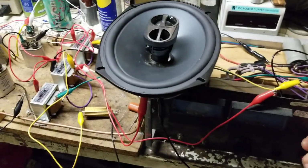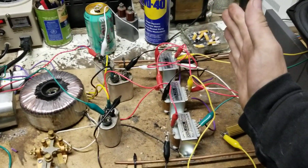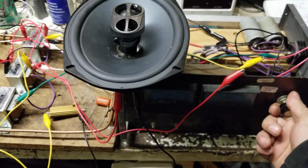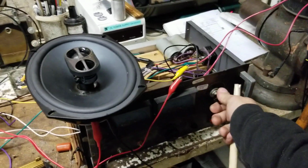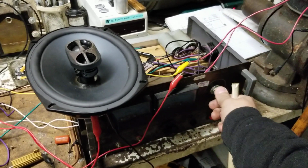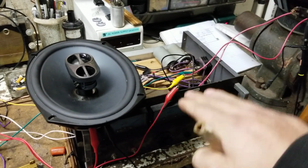So you see now, even in the second stage, without this being turned on, I can regulate the transformer and change the impedance load on this side of the saturation wall. And I don't know if you can hear it, but there are harmonics coming out. The lower the voltage tap on the transformer, the higher the harmonic. So here's a high one, and then there's a middle one. And now you can hear this one's a little bit above. Anyway, it's interesting how that affects it.